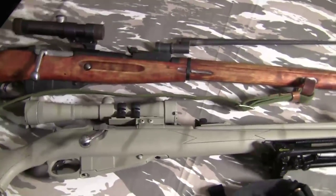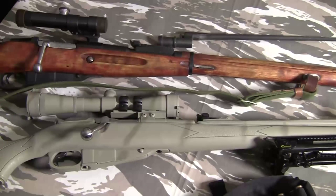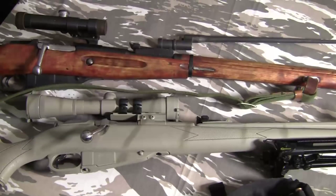Take into consideration it's not meant to be a sniper rifle anyway. So if you've got one that's counterbored, don't cry about it — but if you can avoid it, that's probably better. While you're at that end of the gun, stick a light inside and see the condition of the barrel. Make sure the lands and grooves are good. They're all going to be dark because they've all been used, but just make sure the barrel isn't shot out.